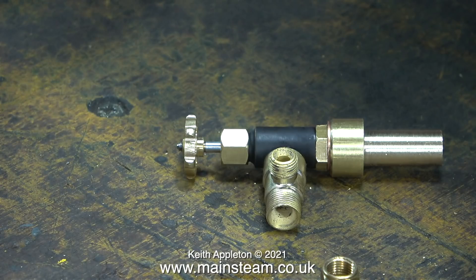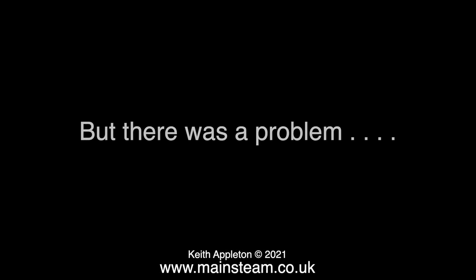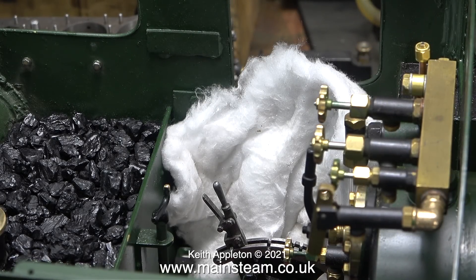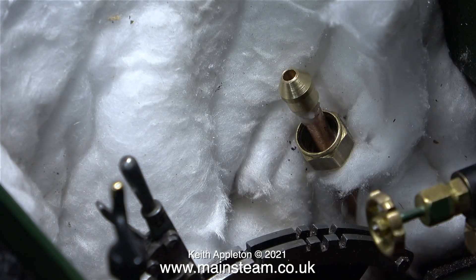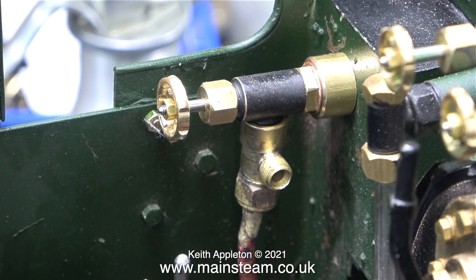Now that the tee piece is looking a lot better, it's time to fit everything in position. But there was a problem — the original union nut on the pipe and the union cone was not the right size. I had two choices: one being to make a new tee piece, and the other to re-silver solder a proper union on the end of the pipe. I chose the latter option and applied some silver solder flux to the pipe, after which I fitted a union cone and silver soldered it in place. In case you're wondering what this white stuff is, it's thermal insulation material and it is really good — this allows me to use a blow torch in a very small confined space without burning off the paint or damaging anything else. It ended up not being the neatest silver soldered joint I'd ever made, but it will clean up.